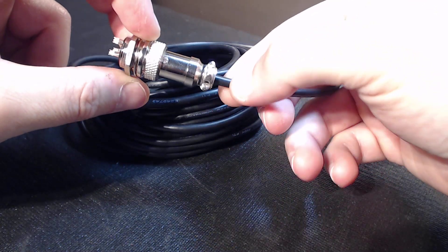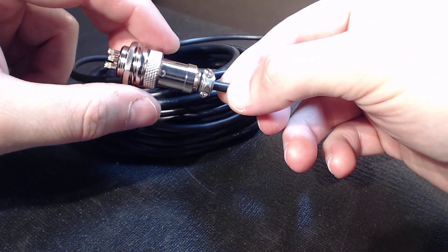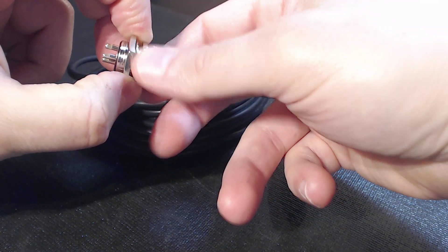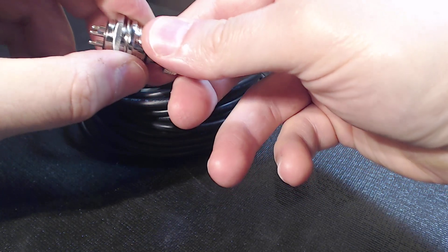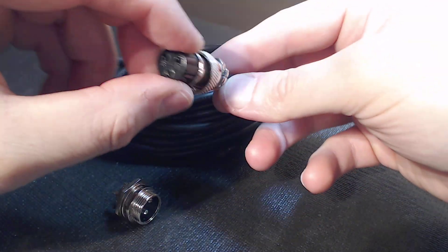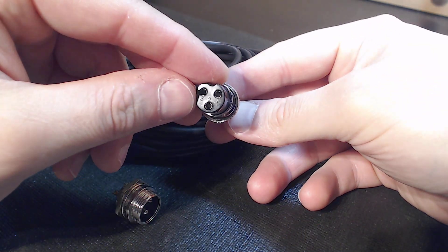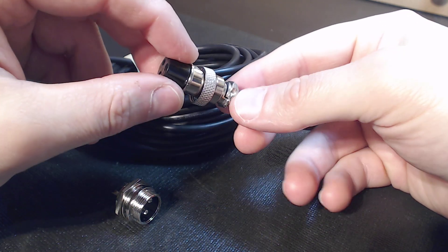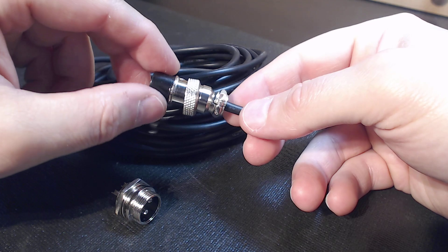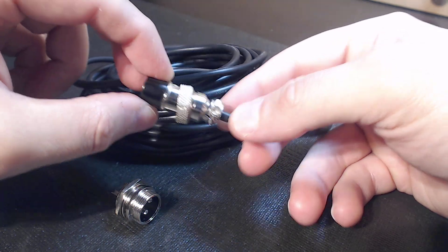The connector used is a GX16 3-pin. To take the guesswork out of properly draining and grounding the system, your ground and drain is already hooked up on pin three — all your drain goes right to pin three. You can see here on the connector it's labeled one, two, and three. These connectors make everything connected to them just a simple hookup procedure.